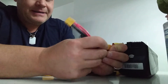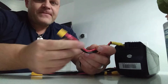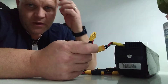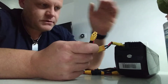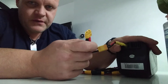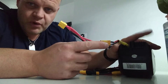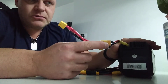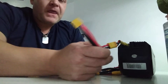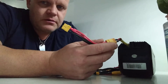If my controller had a female connector, I'd be able to get the first battery connected, get the second battery connected, and have this go to the controller. What we're doing is 20 amp-hour on the other battery at 48 volts, and 13 amp-hour on this battery - that's 33 amp-hours total. Hypothetically 30 amps from one battery and 30 amps from the other gives you 60 amps at 48 volts - totally doable.